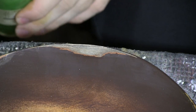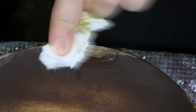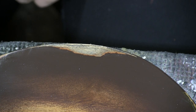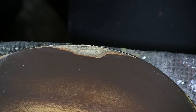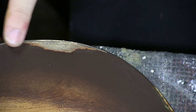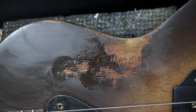We'll blob the vinegar on like this, let it sink into the wood, and see how many times we need to do it. We'll start with one layer, come back to it once it's dried and starting to have an effect, then decide what to do after. About two hours later, it's dried and really sunken in and gotten gray. It looks a little flat to me, so I'm going to put a bit of oil on and work it back and forth, cleaning off the excess. I think it looks pretty good now — maybe a little bit too dark — so I'm going to go through the body again, putting on little dabs here and there trying to get it looking even and well-spaced.